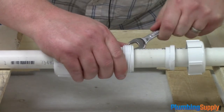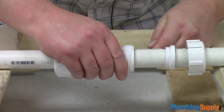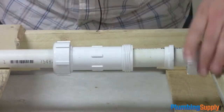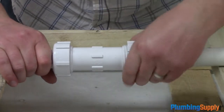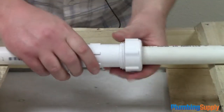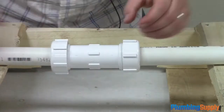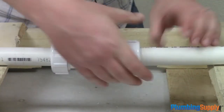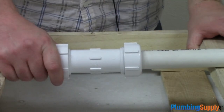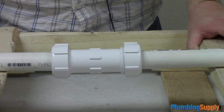I'm using the end of a half inch wrench — that may or may not be the proper tool for you. With the O-ring in its hole, you can once again tighten that nut down. Once you get everything nice and tight, you can get the water pressure back to the pipe and do any final tightening to make sure you have a watertight seal.